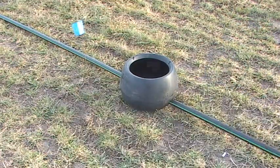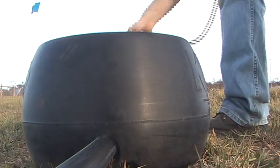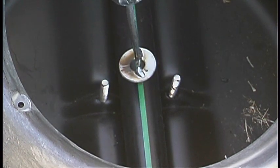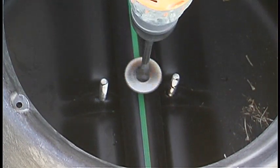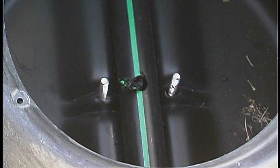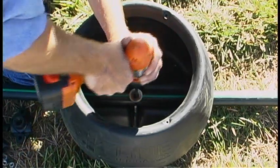When the pods are in place, it's necessary to assemble the sprinklers and attach them to the tubing. First, drill a hole into the pipe with a 9/16 spade bit, using the green line or lines as a guide for the placement of the hole. Be careful to only drill through the top side of the pipe. A washer may be welded to the drill bit to keep the bit from drilling into the bottom of the pipe.